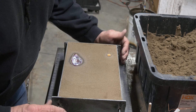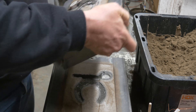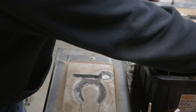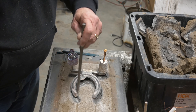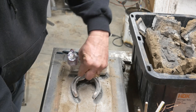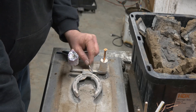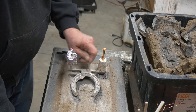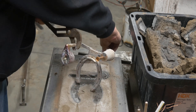Alright, we're cooled off. Opening this thing up — it looks good on that side. Everything filled up on the cope too. You can see that part that broke out — it's right there. But other than that the parting lines are really clean, nice definition in the part. As I'm cleaning this thing off, I notice there's something going on back here I'm not happy about. There's a hole right there.